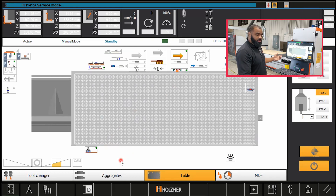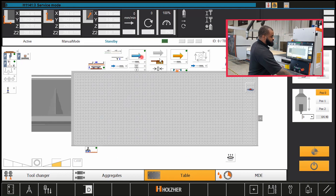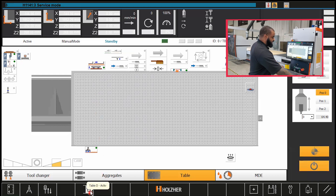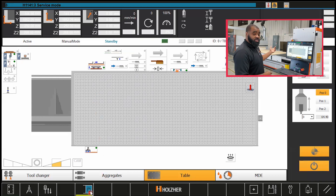You have to have your password entered to activate this button. Click it and turn it green. Note that if you hit reset or deactivate the table, that button will turn off — so make sure your button is green before you walk up to the machine and turn on your vacuum. For automation options — the infeed and outfeed — turn off those main buttons at the top. We're not loading anything on the table and not pushing anything off, so we don't want those to activate. At this point we are ready to activate our table. I'm going to activate my zone — in this case F5. Depending on whether you have multiple zones, you may use F4 or F5. It should turn blue and your pin should come up on the actual machine.